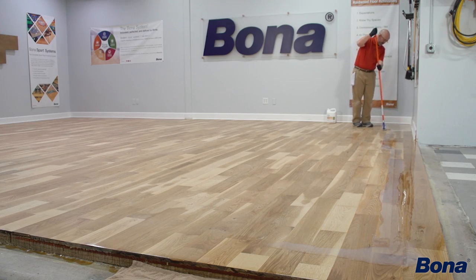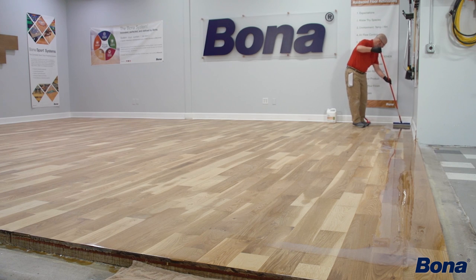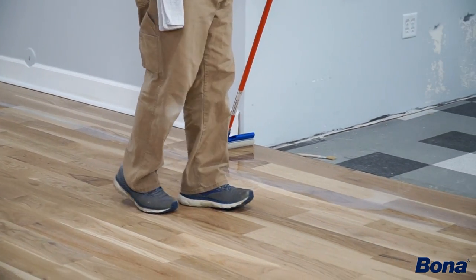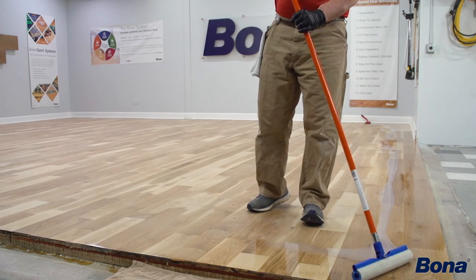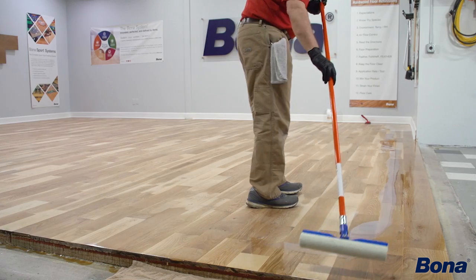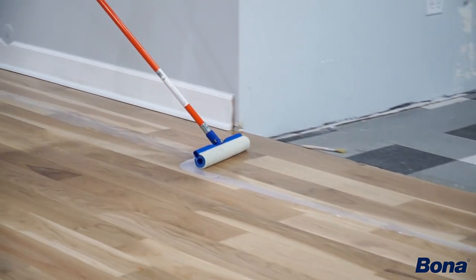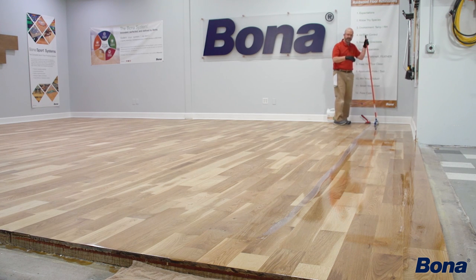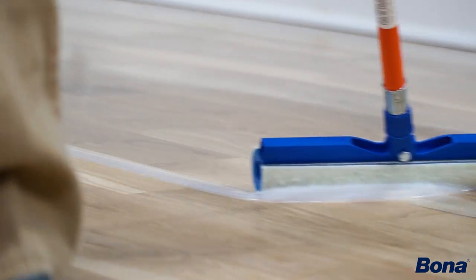Some guys will say stay away from the wall where the cutting person just worked, and yeah, I don't want to redo that work — but to make sure nothing has set up or to straighten anything out, I will go back over the cut-in work just to make sure everything is coated. Then we're running our regular snowplow method runs — coming down, running it like a snowplow, having that excess run off the end. That's how we manage the puddle, working our way out from there, cutting in as we go either behind or ahead of ourselves, and adding more finish to the puddle as we move across the floor.